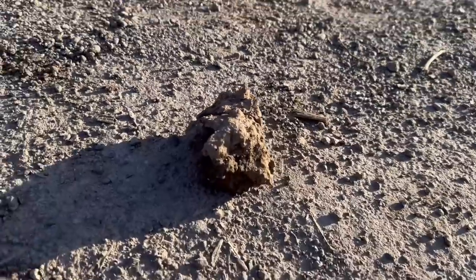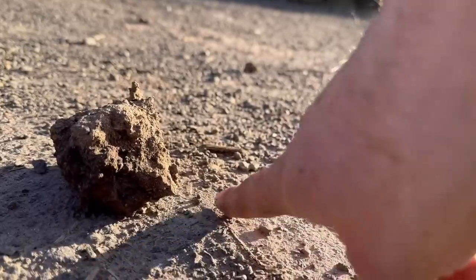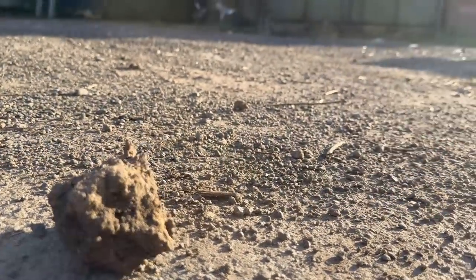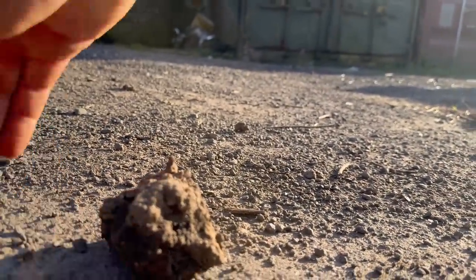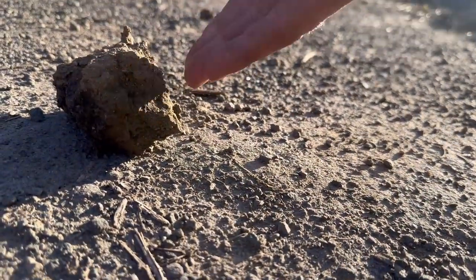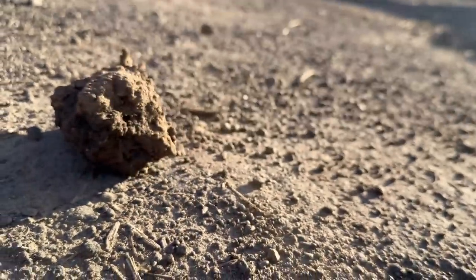How we avoid shadowing with forwards and backwards nozzles - I'll put a piece of soil down and show you. If you came along with a sprayer and just sprayed over the top of a clod, you'd get these bits underneath that wouldn't get sprayed, and you can get weeds popping up around it. If the nozzle faces forwards it goes underneath and over the top, but then you've missed the other side. If the other nozzle faces backwards, it fires underneath from the other direction. So by having forwards and backwards facing nozzles you can spray underneath clods in two directions - they're also coming out at a diagonal to get under the corners.